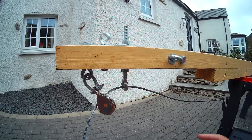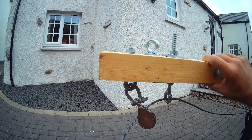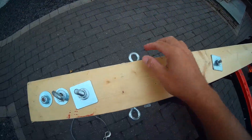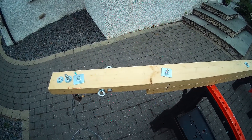So as we're lowering the mast, to stop it from moving sideways — moving that way or that way — as this end is going up, I use these eyes here with ropes going down to a secure point, like the toe rail or base of a stanchion. There's not a lot of strain on there — it's just to keep it in balance and stop it moving to either side.